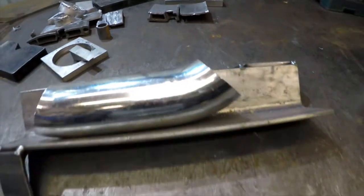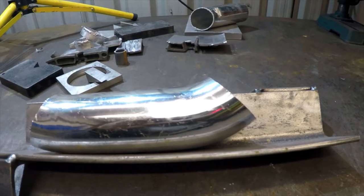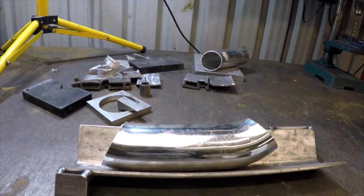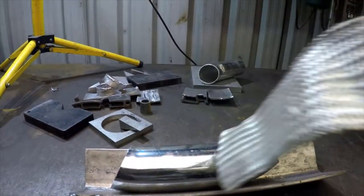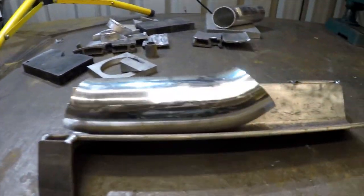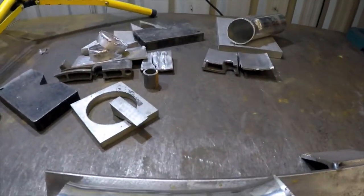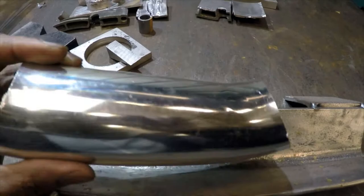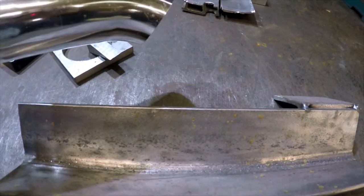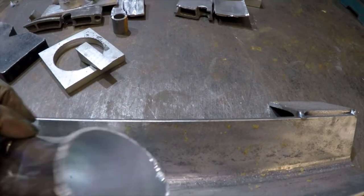Obviously make sure you've got the right protective equipment — that's a welding helmet and gloves. Another thing I bought is a welding finger guard; you put it on two fingers and it allows you to rest on something warm and slide your hand across. That's come in useful to stop you getting burnt because it does get hot. Next important thing: make sure whatever you're welding, especially aluminium, is clean. Clean is your best friend. If it's got any coating, oil, or residue it's going to make the welding not go to plan.